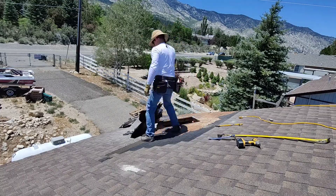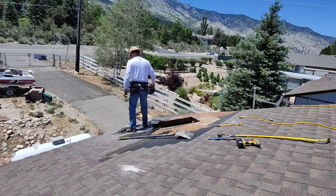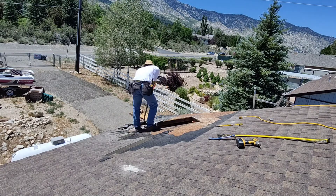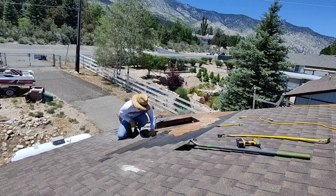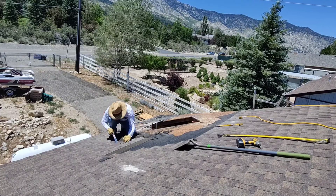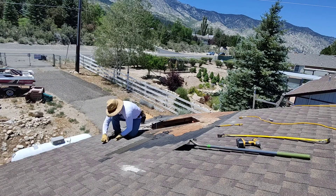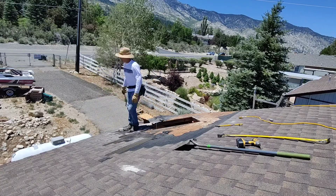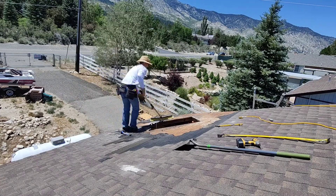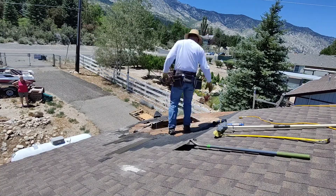Here I'm removing the old roofing — the shingles and the underlayment around the old chimney opening in our roof — so that I can get to the plywood underneath. We need to cut away quite a bit of the plywood to repair it, and not just the plywood but also the roof structure. Three of the roof trusses end on a load-bearing wall at a 45-degree corner of our living room, supported by an interior wall that creates the front of our old fireplace, which we're trying to get rid of. I have to get the decking off to get to those cut trusses, then re-establish them and sandwich them in plywood to make it strong, sturdy, and code compliant.